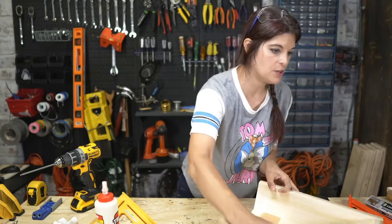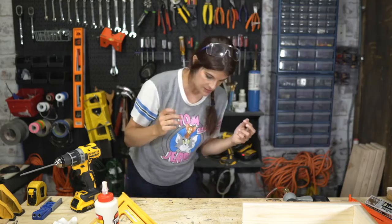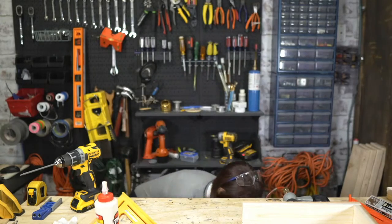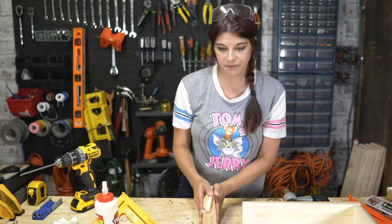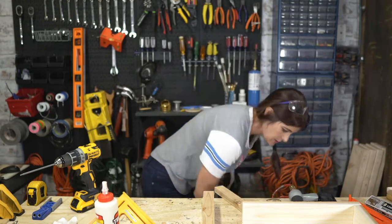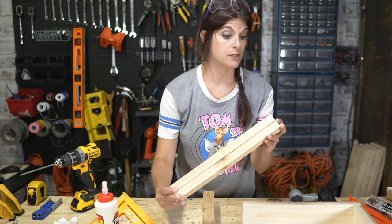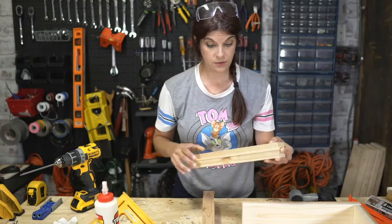All right, so what kind of front are we going to put on this? Normally, you can just cut a piece of wood and do that. Now, for your opening, you want to accommodate 1/8 inch all the way around: top, bottom, side, side. So all in all, 1/4 inch from your length measurement and 1/4 inch from your height measurement. I already did that. Let me see if I picked the correct one. We're going to use another method to join flat pieces of wood. Let me make sure that this is the correct one. There's this one and this one. They're slightly different. So that's longer.